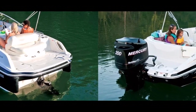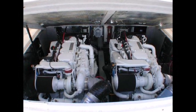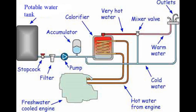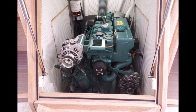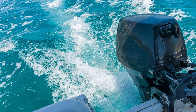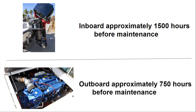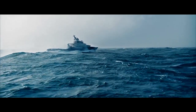As for inboards versus outboards, both have advantages and disadvantages. Inboards take up a lot of interior storage space, cost more initially, and you cannot take them to a mechanic — you have to have a mechanic come to you, which can be expensive. But from a liveaboard point of view, there are a lot of advantages. You can attach things like heat exchangers for heat or hot water, larger alternators for more electricity, and for the do-it-yourselfer they're easier to access and work on. Inboard gasoline motors generally last longer — roughly 1,500 hours before necessary maintenance — compared to outboards which last about 750 hours on average. So the inboard option means nearly half the maintenance, even though they cost more initially.